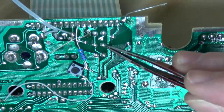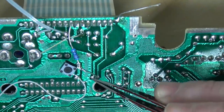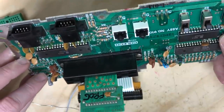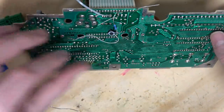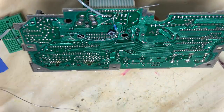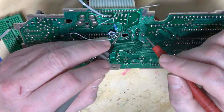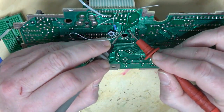So you've got this fake via here that didn't go anywhere. Then you've got something down there — is that actually a via? Of course it's covered up by this cartridge slot. I don't want to remove the cartridge slot. Where does this beeep out to? What would you use negative five for? Because everything — the 6502 and the 6532 — are both five volt parts.